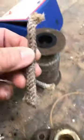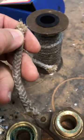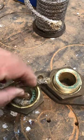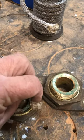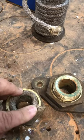What is packing material? Here's packing material right here. It's graphite impregnated, and this one's teflon impregnated — it also has a wax in it. This goes down into the packing gland, and you make several wraps of it.